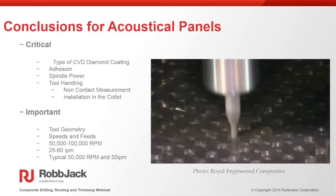When using diamond coated or PCD tools, tool handling is critical. Diamond is very hard and wear resistant, but it has brittleness. You don't want to use contact measurement like micrometers or calipers — use vision systems, microscopes, or other non-contact measurement methods. Make sure tools are stored in tubes, and train operators on consistent handling. If tools are chipped before they go into the spindle, you won't get the performance out of them.